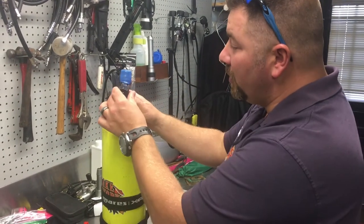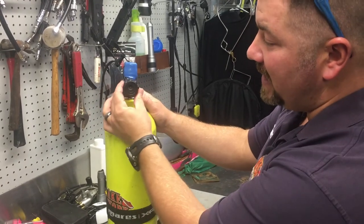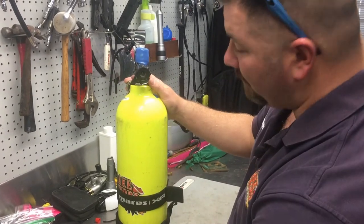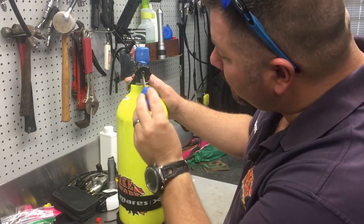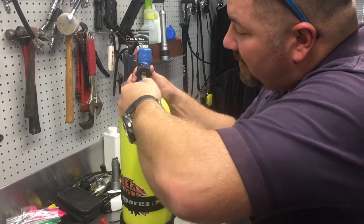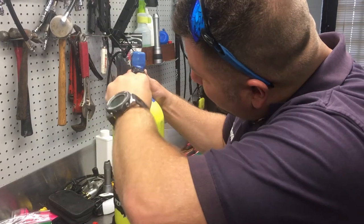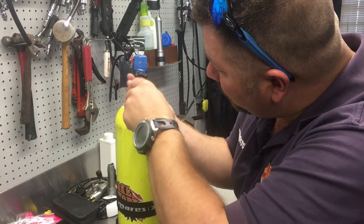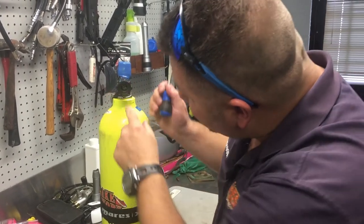Simply replace it — make sure your spacer is in place, then put your turn knob, or wheel, up until it engages. You can see it's engaged and not turning left or right. Now replace the spring and set that little nut back up in there. It takes a little bit of force to compress the spring, but simply compress it and turn the nut until it engages the stem — takes about two or three tries. Once it's engaged, you can screw the nut down.